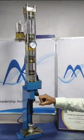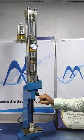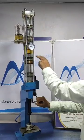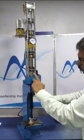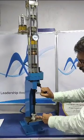Now we will actuate the lever further so that the power stroke will be introduced. This is the power stroke — the intensifier piston has travelled and compressed the oil, and because of the increased oil pressure, the ram has come down and applied the power stroke, compressing the spring fully.